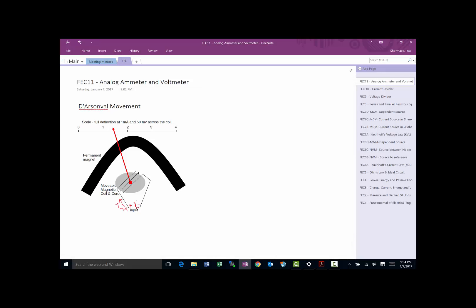These D'Arsonval devices are essentially what all non-digital analog gauges are built upon. There is a material that gets magnetized by wires wound around it carrying current, a permanent magnet, and a needle that moves from zero to full movement. To fully analyze this we'd need knowledge of inductors and electromagnetic fields, but fortunately we don't need all that to do our circuit analysis.